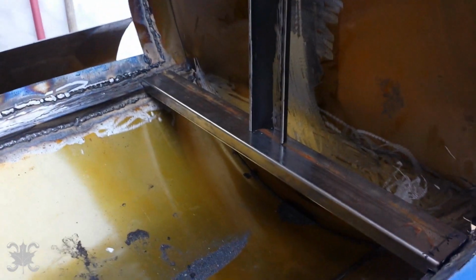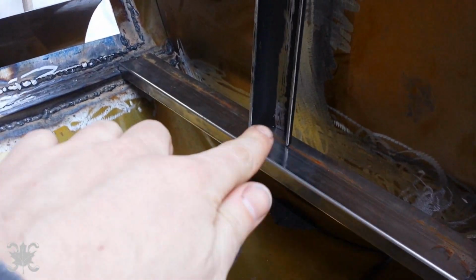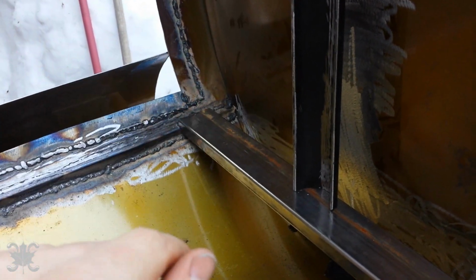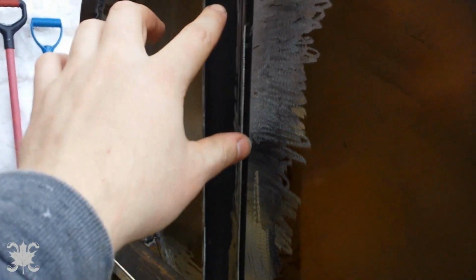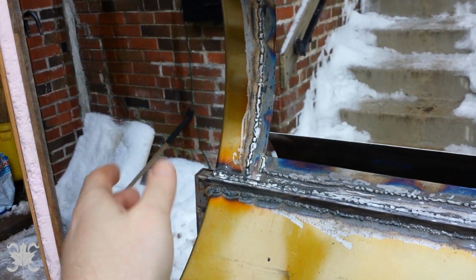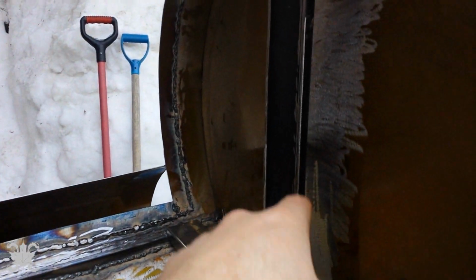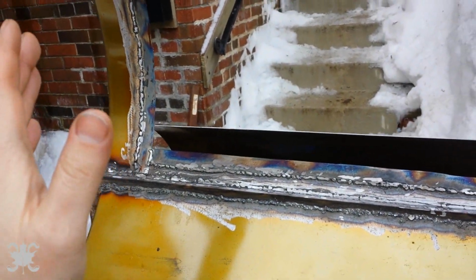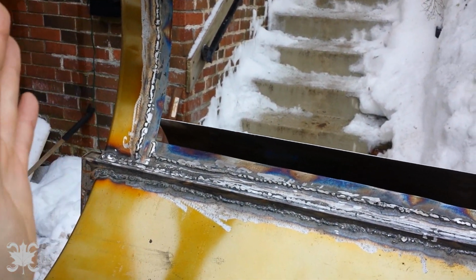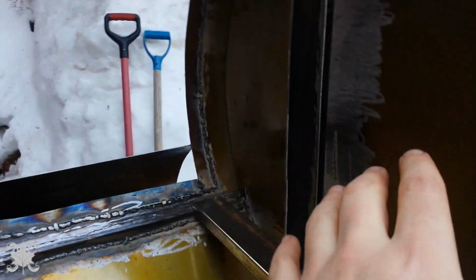I'm just thinking it through, and I think what I might do is weld that so I know that it's square. The hard part is knowing how it's going to be square on that axis, unless, of course, I lay it on the table and do it first. But point is, I don't want to weld it there and at the top yet, because this female portion of the front side of the barbecue needs to mirror perfectly with the other side. If, when the grill apparatus goes up and down, they're not perfectly in line, it's going to pinch either high or low, or left and right. They need to be perfectly parallel.